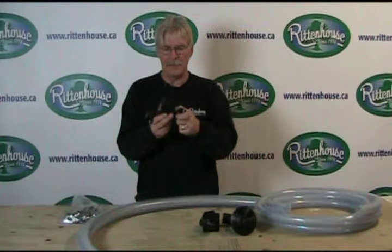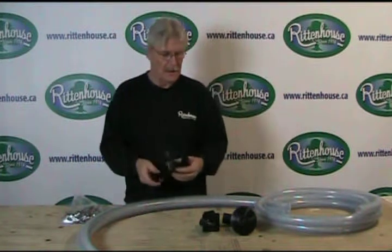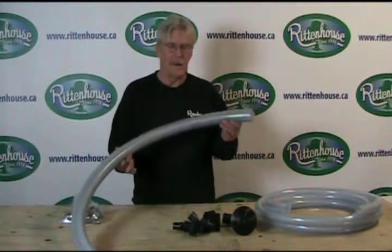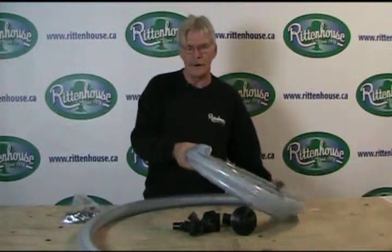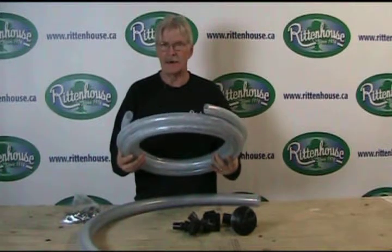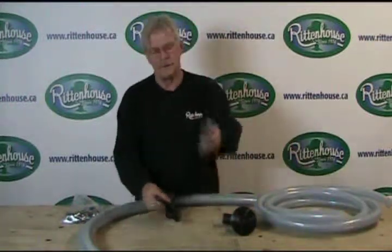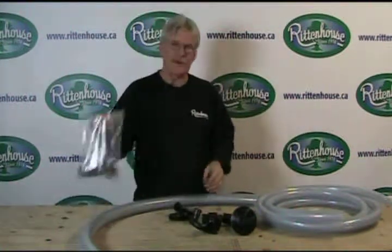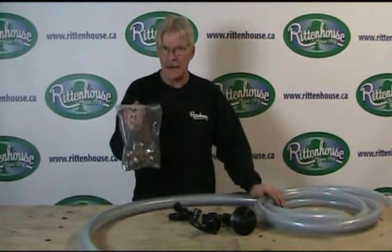You can angle these up a little bit, or one down a little bit — that may help stir up your product. The large hose you see laying here is wire reinforced — that's for the suction side. The smaller one, one inch, is the return from the pump to the tank, and also the hose that drops inside the tank to attach these two pieces together. And you have the assortment of clamps used for the suction, the return, and also to fill your boom.